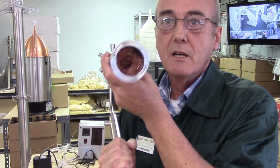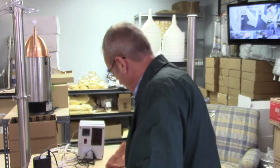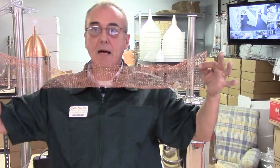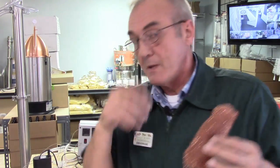It slides into the end of the column — just tight enough to fit and not fall out, but not so tight it blocks it up. I'll normally use two separate rolls. The bags of copper that come with this have 30 feet, so you're only using two pieces about double arm's width. Now — plates as a measurement: one four-inch roll of copper is equivalent to about one plate in the measurement field. In larger four-inch-plus columns, you'll have a copper bubble plate, so someone might say 'I've got a still with four plates.'